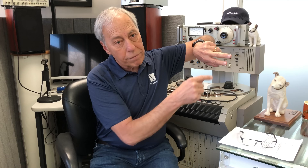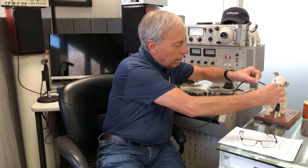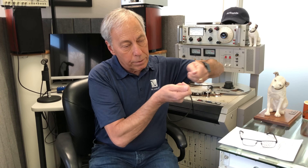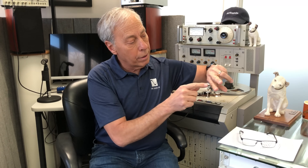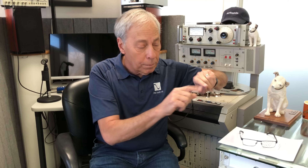Here's where it gets really cool. If those two signal wires — the inverting and non-inverting — pick up the same noise at the same time, like hum from a nearby transformer, both of them will pick it up since they're bundled together in the cable. But the differential circuit on the other side eliminates that hum because it pays no attention to anything that is common between the two hots. Common distortion from the transmitting unit, or common noise picked up along the way — it ignores all of that and only amplifies the differences. That's a much cleaner, much better-sounding signal, and that's why I always recommend balanced over unbalanced.